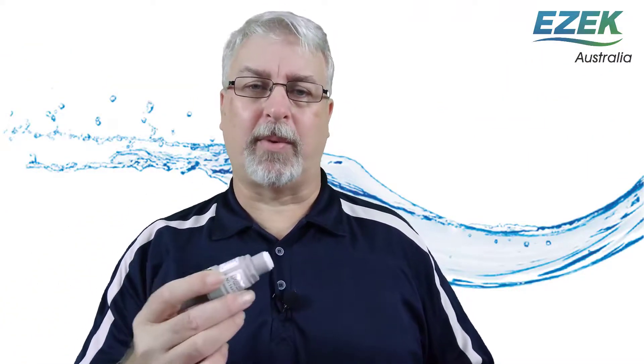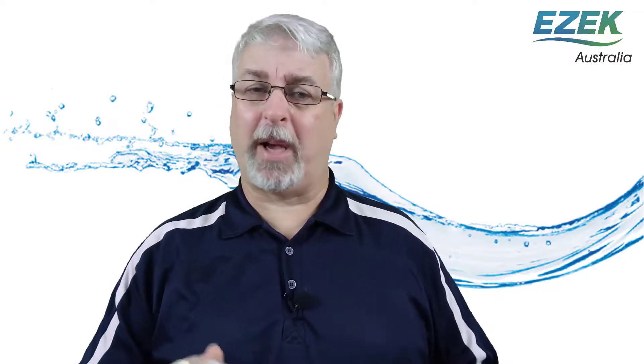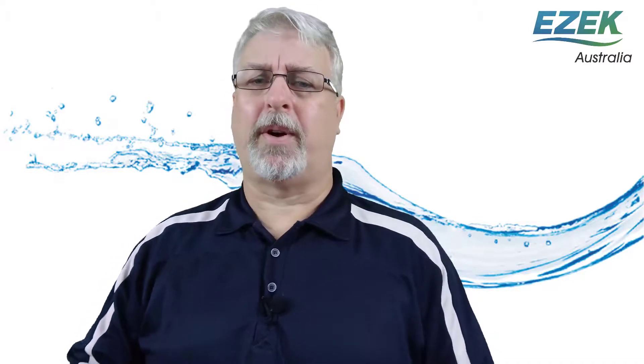So what we'll need to do is grab a pressure limiting valve or PLV to limit the water pressure to less than 500 kilopascals. These can cost anything up to about $80, but I got this one off eBay for just $16. It's a push lock connector style which is really easy to install. There's a bunch of these on the market around 350–400 kilopascals designed for fridge filters, which is perfect for what we want to do with them. They come to suit either a quarter inch or three eighth hose.